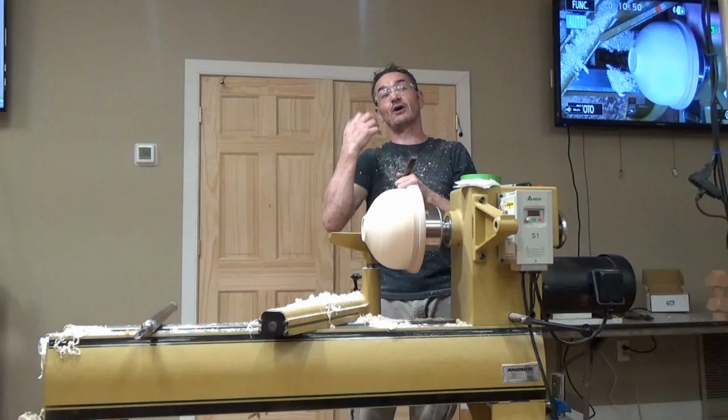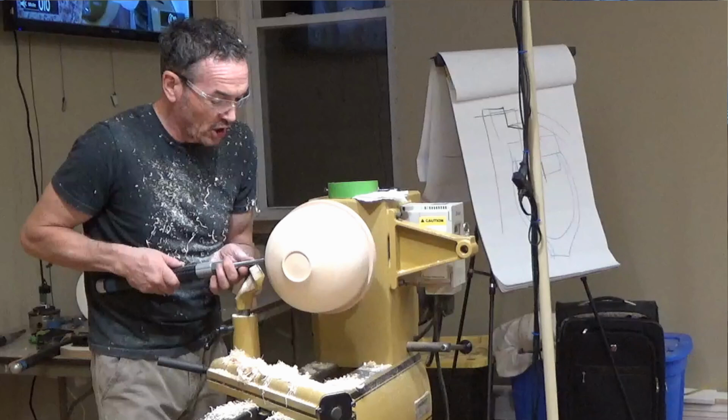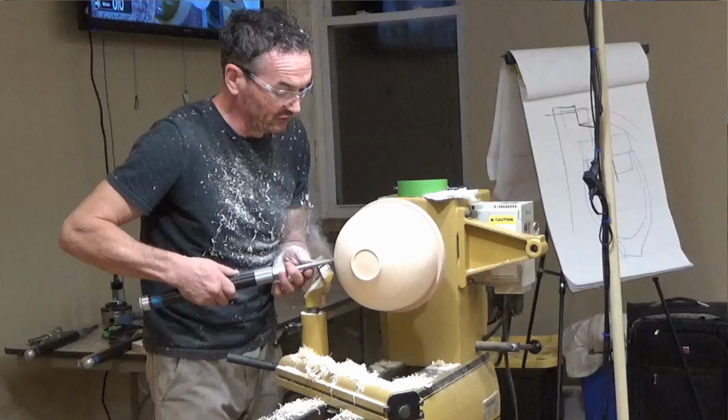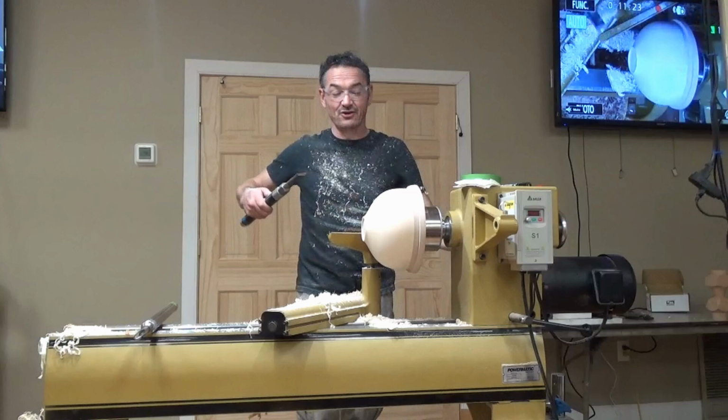Because it has a secondary angle, it does not interact with the end grain by self-feeding. It's neutral. It doesn't push it away, and it isn't attracted to it. So it's a neutral reaction. So shear scraping is taking a chisel, twisting it so the burr is no longer parallel to its base surface. Because this burr is on a different plane to the surface I'm resting on, it does not interact with the end grain.